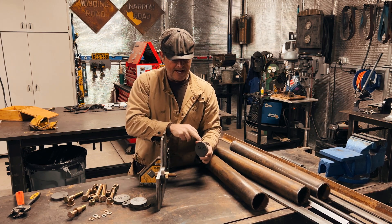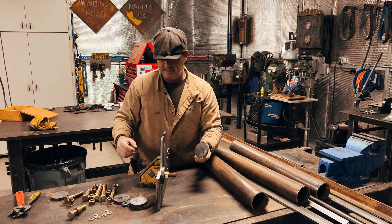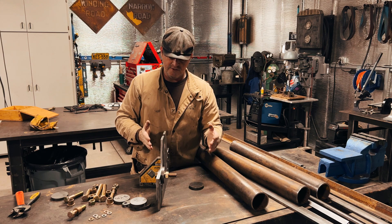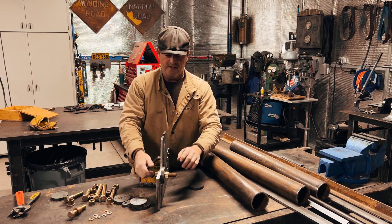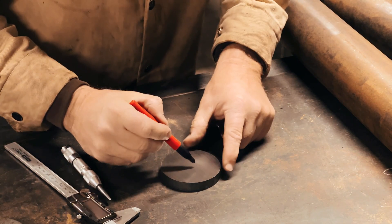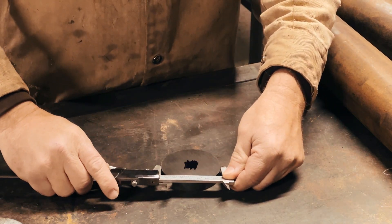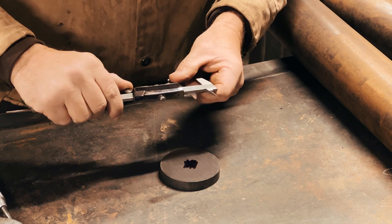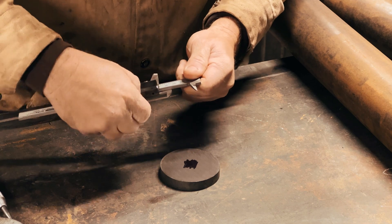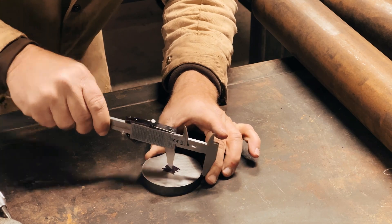So whenever you see me in the video figuring out a way to center this, I want to explain this because some of you may want to build this yourself and you should know the reasoning behind what I'm doing. We take the roller inserts, put some marking ink on them - just using a Sharpie - check the diameter with your calipers, take half of that as your radius, and then go around and mark from several locations. You will end up with your lines crossing over at the center point.